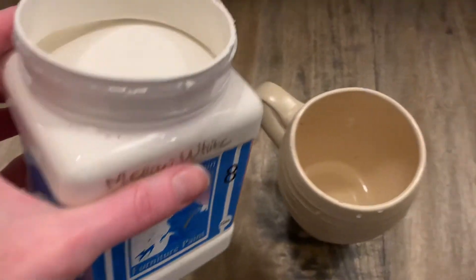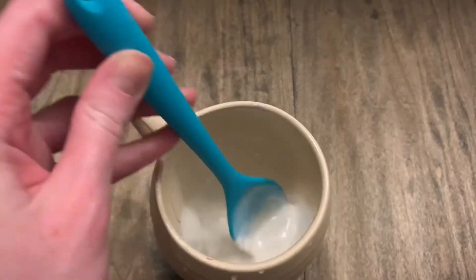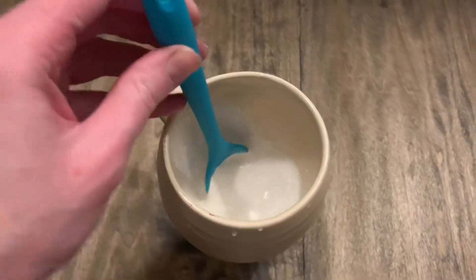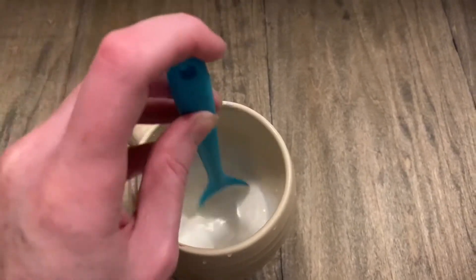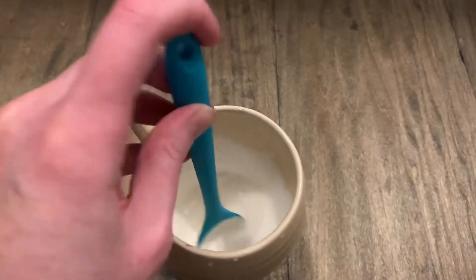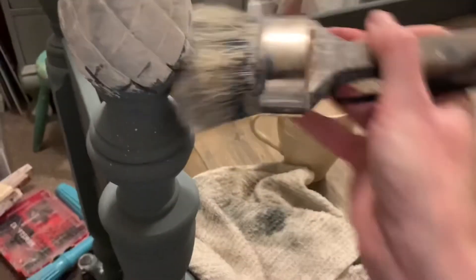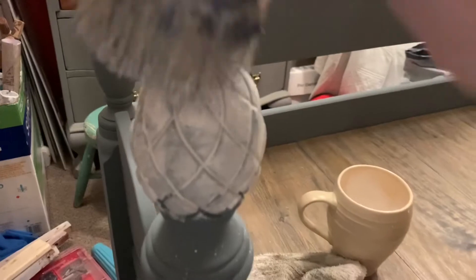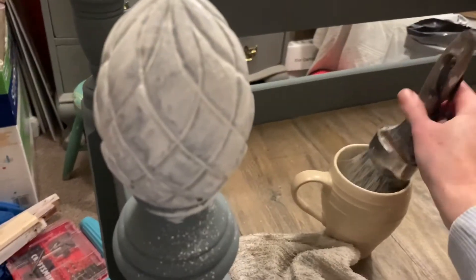I have a bit of water in that cup and I'm going to dump in some white paint. I'm mixing it together — it's going to be like a chocolate-milk-type consistency. This is what we're going to whitewash the bench with. Because this bench had so much detail, I wanted to really bring that out. Distressing the bench too much would bring out that blue, which is not necessarily what I wanted. Making sure everything is very wet so it drips down into all the little crevices — you want to work in very small sections at a time.